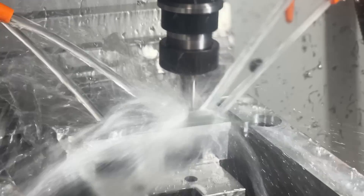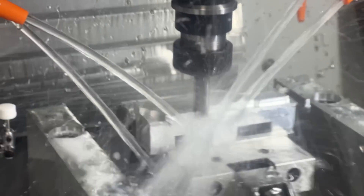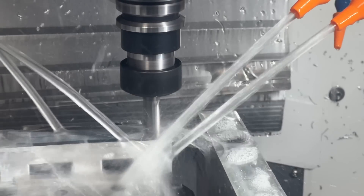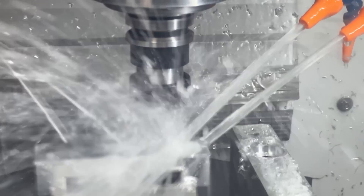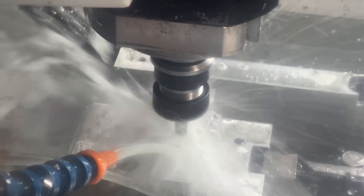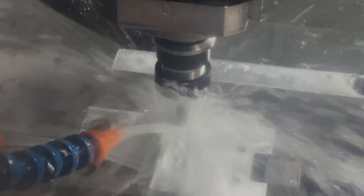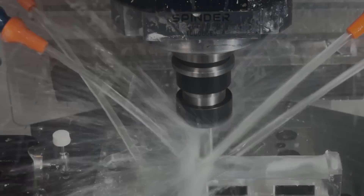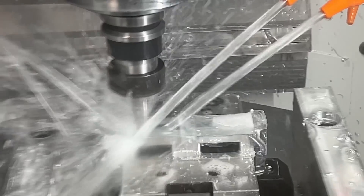I'm back to using the 12 millimetre three-flute end mill. This thing gets a little bit finicky if you go above about 7000 rpm, but it really can shift material. I was slightly nervous about whether the vice would hold strongly enough for really heavy cuts, but the 3D adaptive doesn't seem to be very adaptive — it does a bit of air cutting and a lot of the cuts aren't very deep, so I need to learn what I'm doing wrong there. There's bound to be a setting — it's got to be my fault.